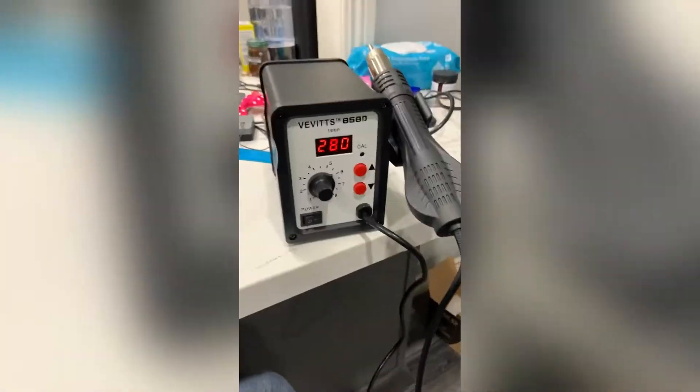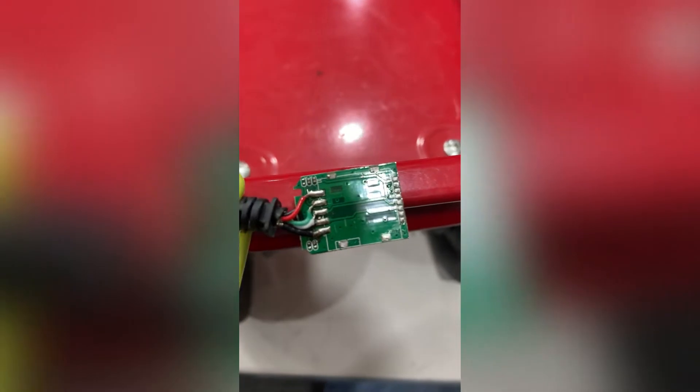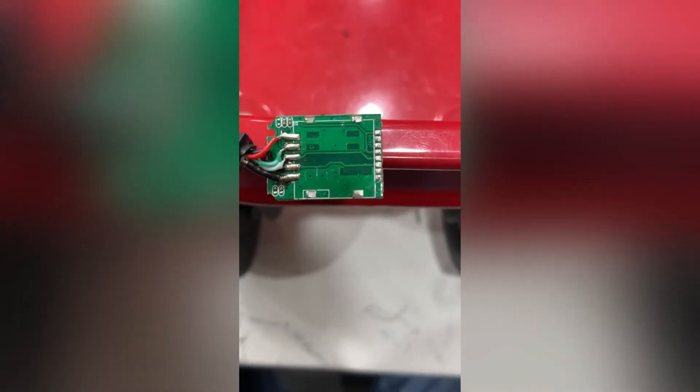We just finished — it didn't come out in one piece. I didn't get the corners heated enough; it's a pretty big area because you've got a four-corner soldering point plus eight pins. I heated all eight pins but couldn't get it, so I ended up wedging and starting at that edge with the pins and finishing out that way. It didn't come out in one piece — there are pieces broken off. This is the backing of it. Hopefully I didn't damage that trace. Yeah, it came out all messed up.